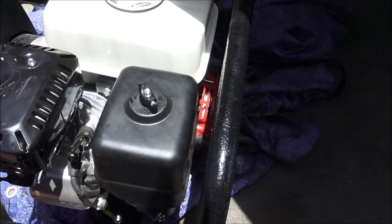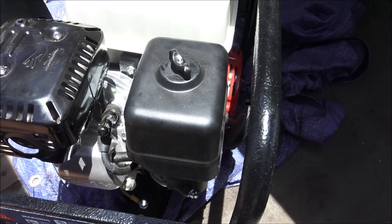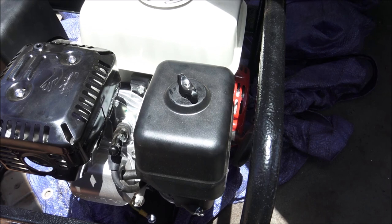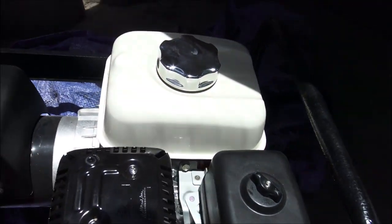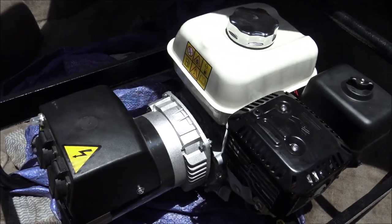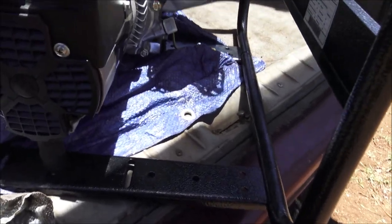The open cradle generators, at least for our temperatures, our climate, and our seasons — particularly in the summer months — are much, much better. They handle hot weather better than the fully enclosed ones. The spark plug is right there, quite easy to get to with a plug spanner. And most of it is all metal, whereas in the enclosed ones a lot of the parts are plastic inside, including fuel hoses and anything else requiring plastic covering.